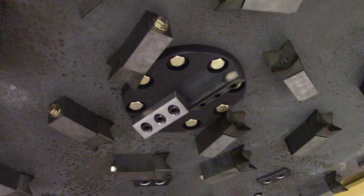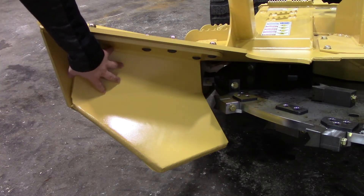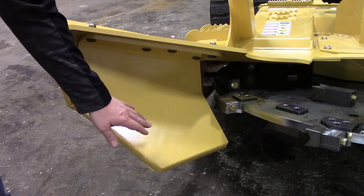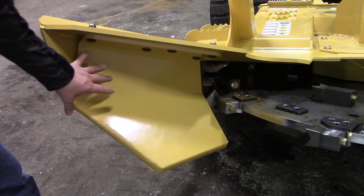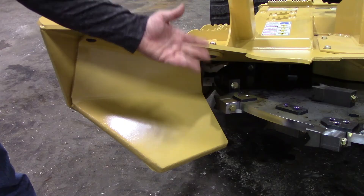Alongside the spindle bolts there are Diamond's patented planing knives, which can be sharpened as needed or replaced when worn out. The Diamond forestry disc mulcher comes with two different configurations for the intake side. The narrow intake is designed for single-stem, taller trees without a lot of lower branches, and uses a bolt-on ramp to help scoop up material and direct it into the cutting surface. The wide configuration removes this ramp, leaving a much wider opening which helps feed bushier trees like cedar more efficiently.